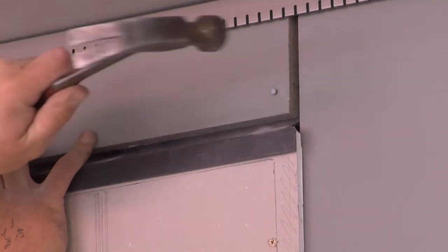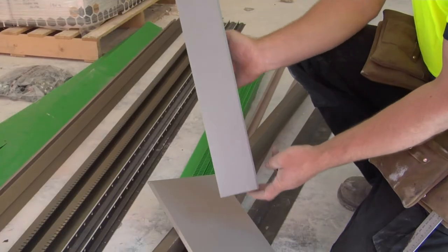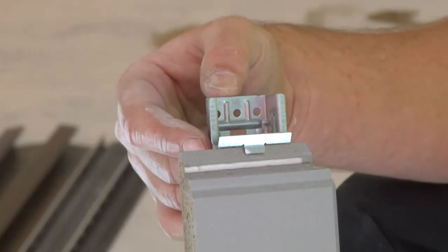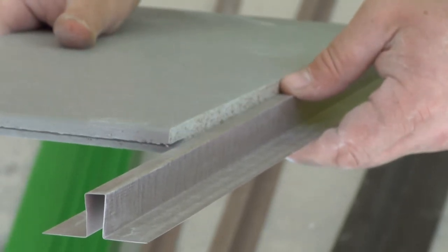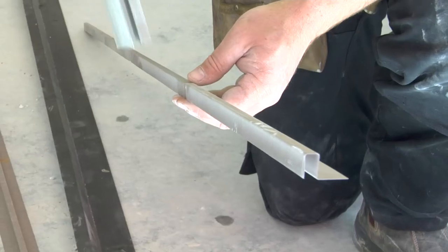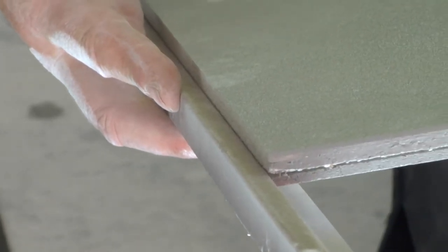These are designed to sit flush with the face of the board. The outer corners can be formed using either an aluminium corner trim or preformed corners matching the texture and height of the boards. Narrower corner clips are used to attach the preformed corners to the frame. A double flanged galvalume steel control joint is used between the preformed corner and the panels, as well as at each vertical junction between panels. Single flanged control joints are available for internal corners or for other situations where a double flanged joint cannot be used.